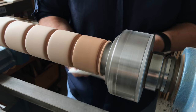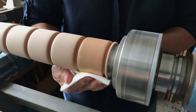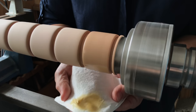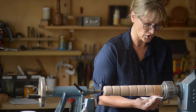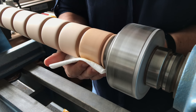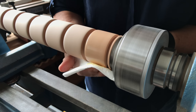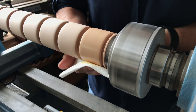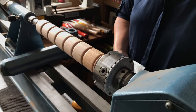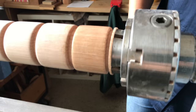In order for this to set, we're going to turn the lathe up to fairly high speed and put constant heavy pressure on. We're going to feel it heating up — it's the heating-up process that will set the polish. It's already quite hot now, and you should be able to see the sheen that's on that segment.